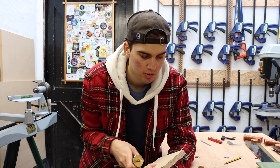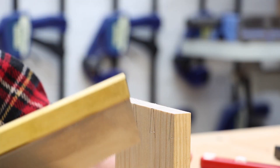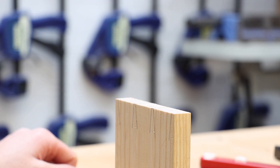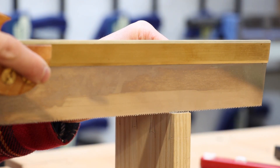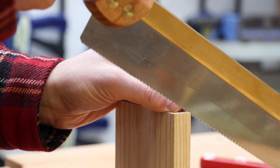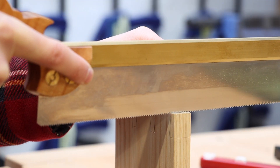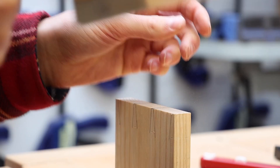All the marking out is done on the tailboard and it's time to cut the dovetails. You've got to commit to cutting straight — if you're slightly wandering off the line, do not turn the saw or you'll have a curved wall. It doesn't matter if you don't stick exactly to the ratio; you probably won't notice in the final joint. I'm using my thumbnail to guide the saw and running back and forth with the saw flat. With 14 TPI, if I angle the saw up it can catch, so I put it flat and run lightly until it creates a groove, then add a bit more pressure.